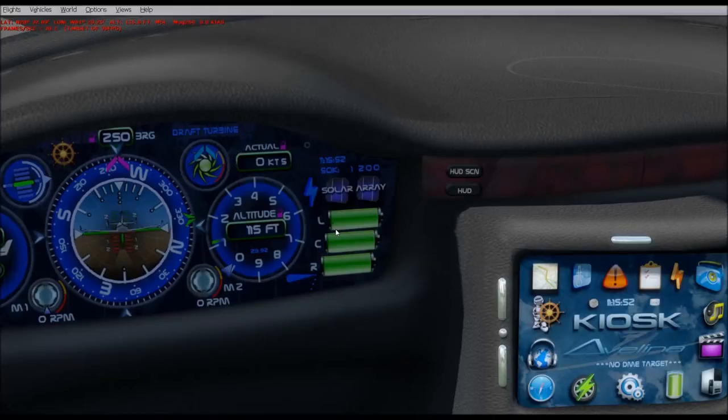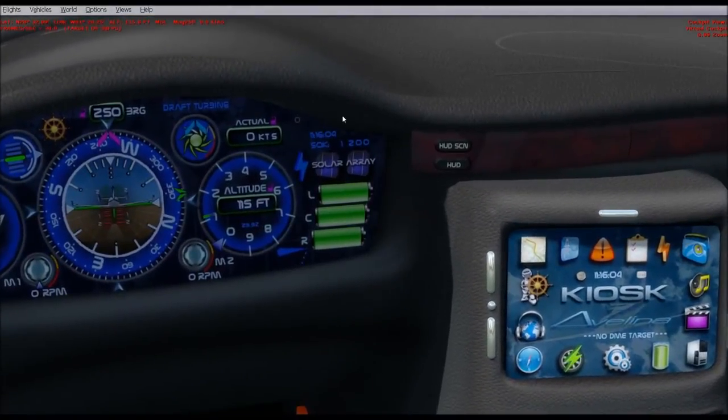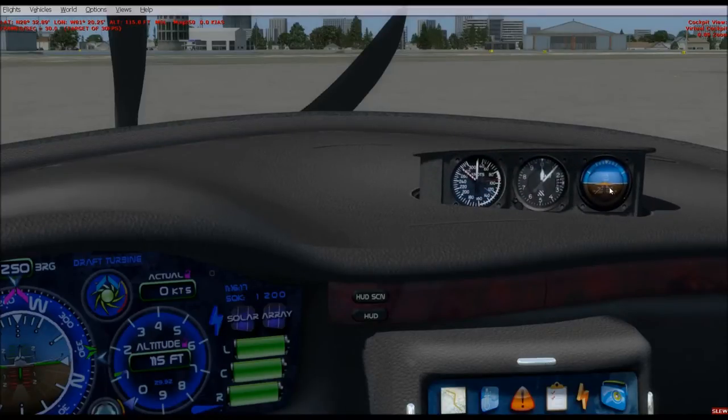All three battery cells drain at the same time — the grid is fully active and I didn't put in a system that separates them. When you get to the end, you'll just have the two chrome caps with nothing in the middle, and you will run out of battery power. When you're out, these screens will die and go black. You then have emergency instruments that pop up — auxiliary gauges including a gyro readout, altimeter, and airspeed indicator so you can maintain safe flying speed.